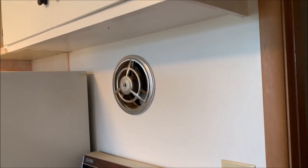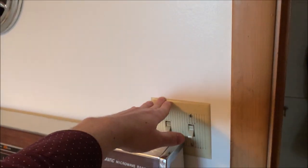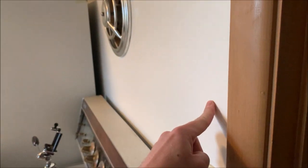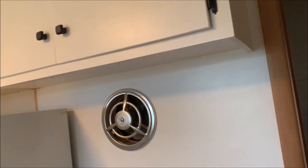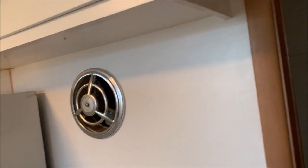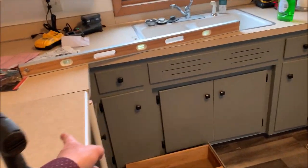That microwave would have stuck out like this and come down too far, which you don't want. We can go about 12 or 13 inches down and 12 or 13 inches out, then the standard 30-inch width. I'm going to my house to measure my microwave — I'm in a rental, I own the dishwasher but not the microwave. Just to have a reference point, then I'll go to the store for appliance shopping and pick up the L-brackets for this.